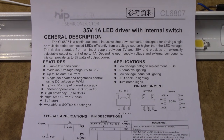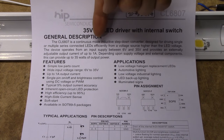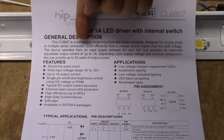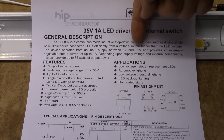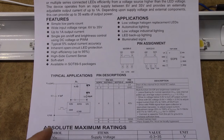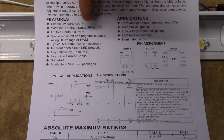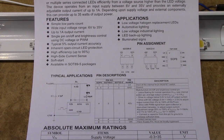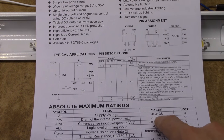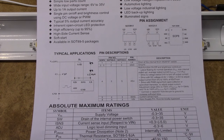Here's just a quick look at the datasheet for the driver chip — it's pretty straightforward. The CL6807 is a continuous-mode inductive step-down converter designed for driving single and multiple series-connected LEDs efficiently from a voltage source higher than the LED voltage. They certainly have it right with a simple, low parts count — that's the entire schematic right there. This is a very flexible chip rated for 6 volts up to 35 volts operation, although the 35 volts is the same as the absolute maximum rating. So I think it makes sense to call this a basically 12 to 24 volt LED driver chip in a really small package.